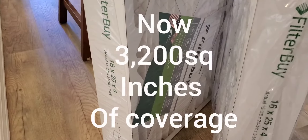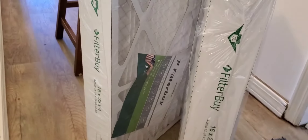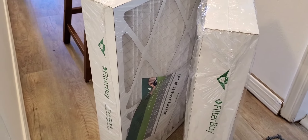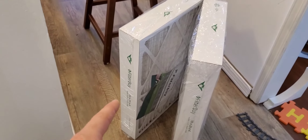In the end, we're gonna get a lot more airflow. This is a tighter knit because it's a MERV 13, but I'm doing a lot more square inches. As I've covered in my other videos, per ton unit that you have — so most homes, 2,000 square foot, are gonna have three and a half to four ton units, especially down here in the south — you're gonna need 200 square inches of filter coverage per ton. That would be a minimum, and that's gonna be a high flow air filter that's not gonna catch very small particles. So going to this type of filter, a MERV 13 — MERV is M-E-R-V — I'm restricting more airflow by going to a higher MERV rating, but I'm increasing the total number of square inches. So let me put this together and we'll see how it goes.